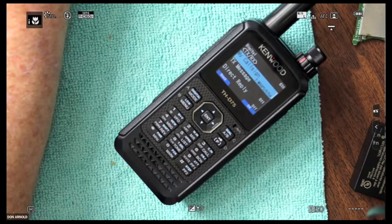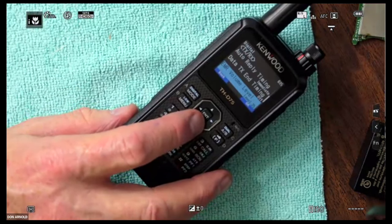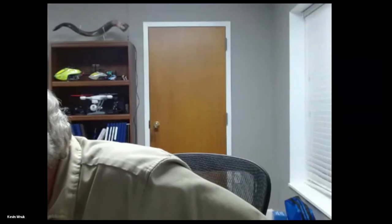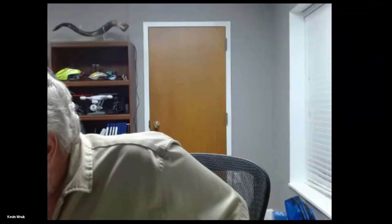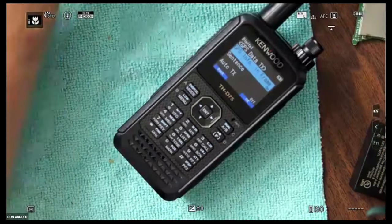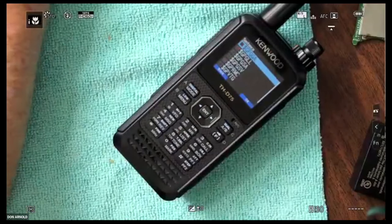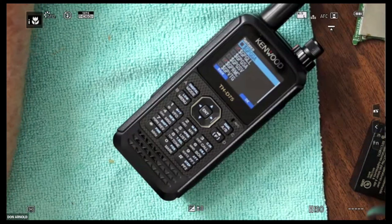Now here's that important one. The GPS information in frame. You gotta turn that one on. What's that number, Kevin? Actually, do it faster in the menu. It's going to be under GPS data, which is 630. You want to turn that on. Now, you see that right there, it's APRS sentence. You want to turn APRS sentence on. That's the next one down. Now, remember we told you how important it was back in the menu 500 for APRS? Whatever that information is going to go over the D-Star network.